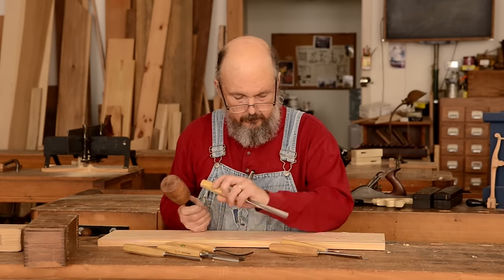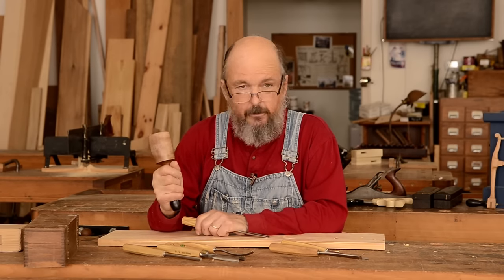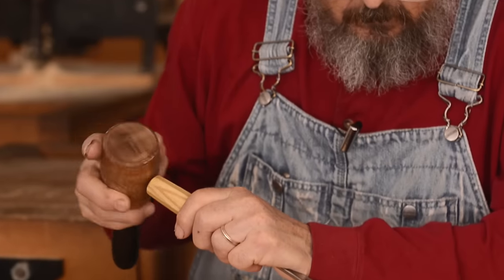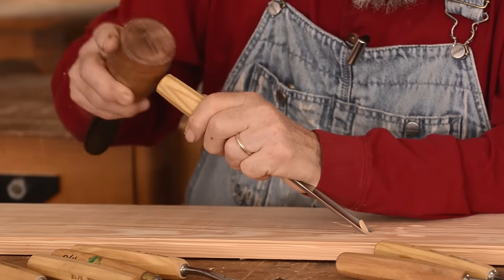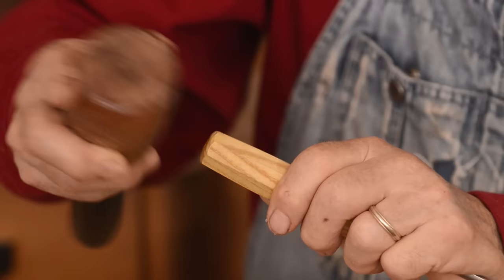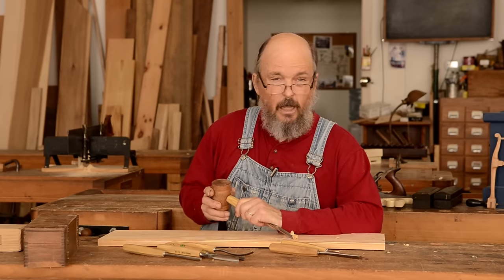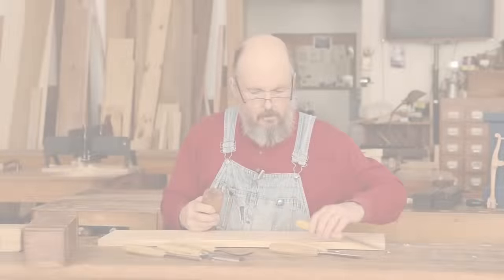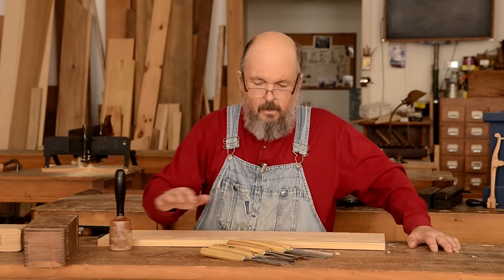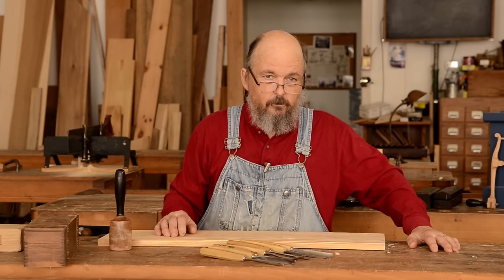The other way to use the gouge is to tap with the mallet. Often, rather than holding the mallet down low and striking in a very heavy operation, people will hold it up here on the head and take light taps. This allows you to steer the chisel and not be too aggressive on the advancement of the cut. I hope that's explained some of the basics of selecting a chisel — the width and curve — and the basics of doing elementary cuts. Thank you.